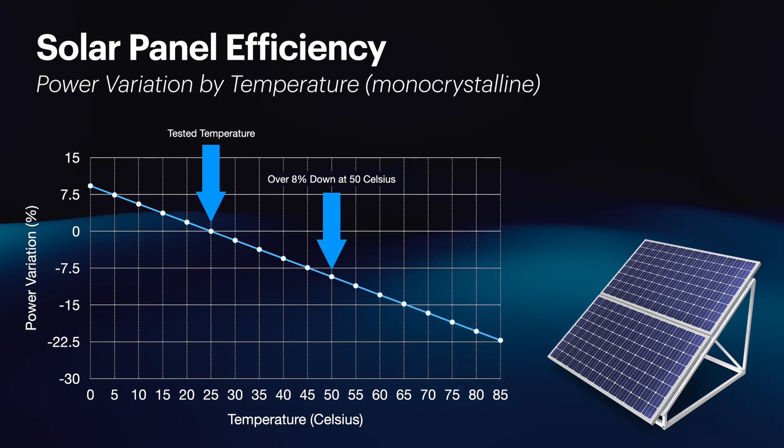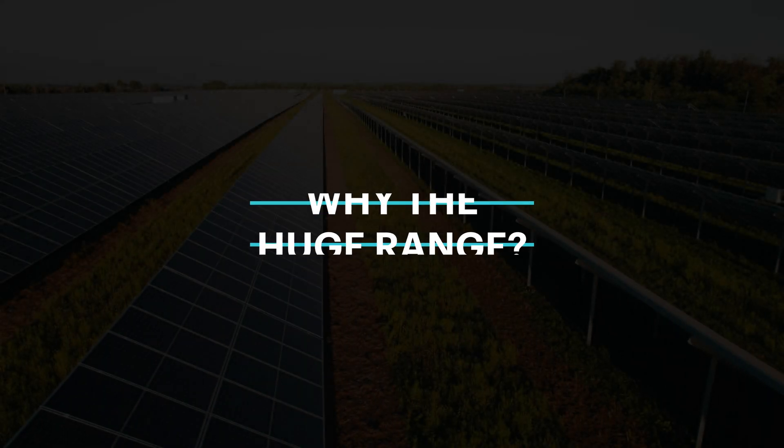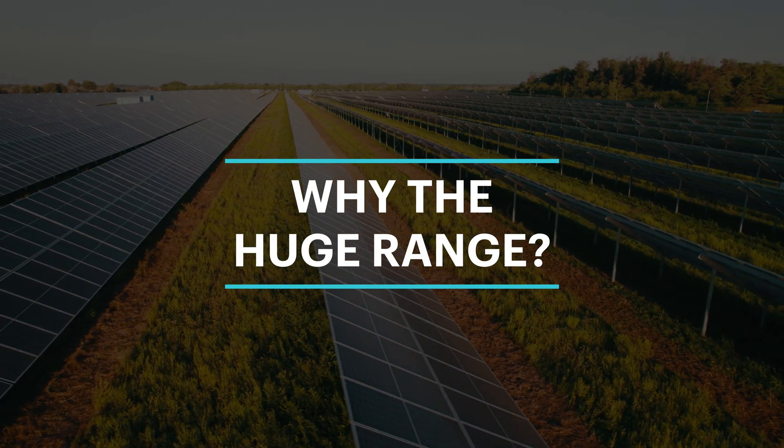Yes, they can theoretically perform and deliver 400 watts, but you're very unlikely to see that kind of output. So why the range? 75 to 90 seems a pretty big range. Different hardware manufacturers produce panels in different ways — they have different efficiencies. I have one 400 watt panel, the large type you might see fitted to a roof, and the best I can get out of that is 350 watts. However, most of the time when it's sat in the sun, it will achieve 300 watts and no more — so 75%, which isn't that good really.